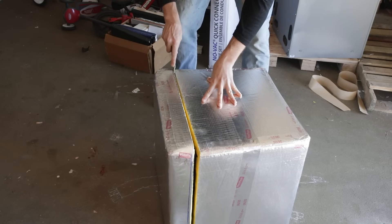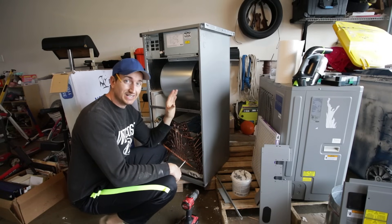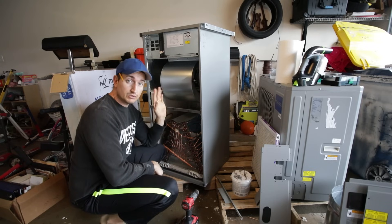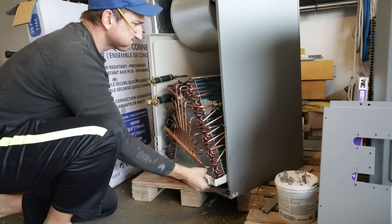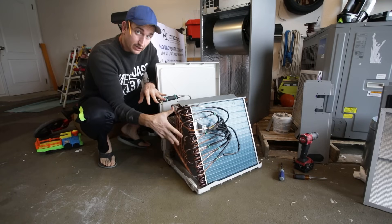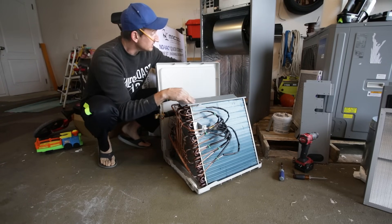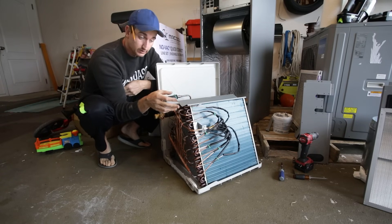Unfortunately, that means we will not have AC for at least another day or two. This unit is super heavy and I don't think I can handle it by myself, so I'm going to disassemble the majority of the air handler and take out the coil assembly to lighten things up. The coil inside the air handler is where air from the blower gets sucked through a hole underneath, out through the vents, and then distributed throughout the house — this is where the heat exchange happens to cool and or warm the house. Pretty critical piece.